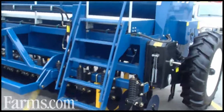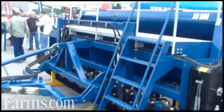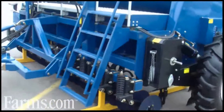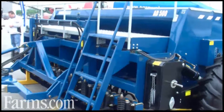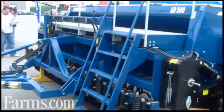The machine is equipped with two boxes: a fertiliser box and a seed box. The metering system is identical in both boxes, so we can actually put anything in any box. We can have two fertilisers for pre-drilling, we can do a cereal and a small seed, or a pasture and fertiliser — whatever you like. Very universal machine.